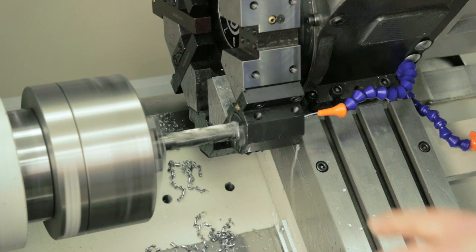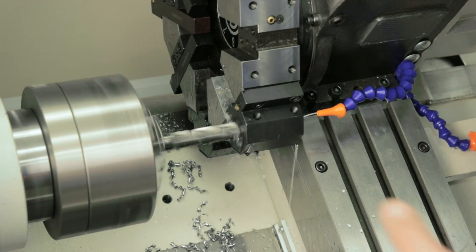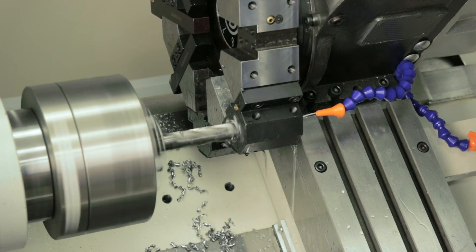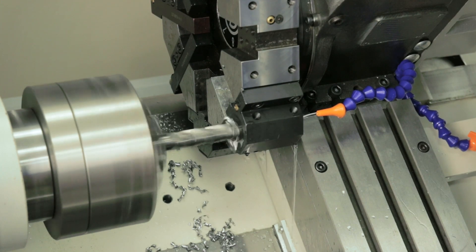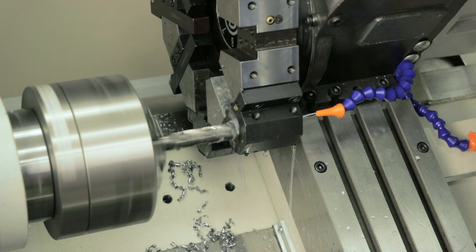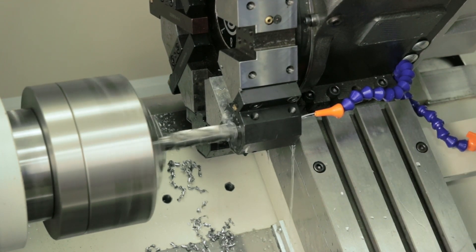The size of this is just going to be whatever size the end mill cuts plunging it — I've got the end mill in a four-jaw chuck and indicated it in true. If you want a real good fit on your tool holders, you might want to consider using a milling boring head so you can adjust your size real fine. If all you're doing is running drills and such, it's really not that important to have a tight fit — just plunging through with an end mill is going to be fine.